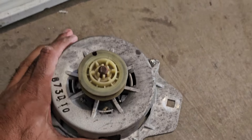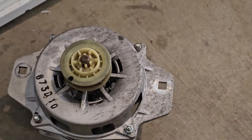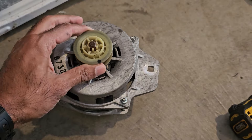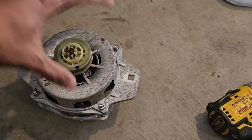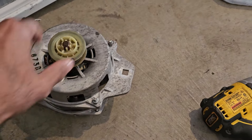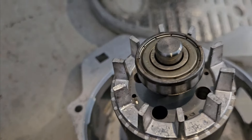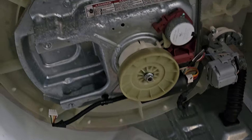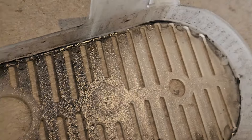The best practice to determine whether the oil is coming from the bearing or the transmission — the bearing in the motor, I should say — is you can spin that and if the oil has leaked out, the bearings are going to be bad and it's going to make a lot of noise. You can also take off these four nuts right here and the motor will disassemble. I just inspected the motor shaft bearings to see if there's any sort of oil leak and there was none. Here's a short clip of when I disassembled the motor just to confirm the motor shaft bearings weren't the ones leaking the oil. That's when I went ahead and assumed the transmission is leaking, which is often the case on these machines — especially given the amount of oil on this belt guard.